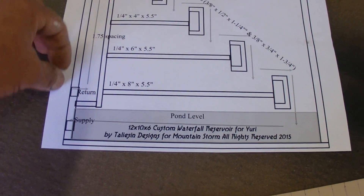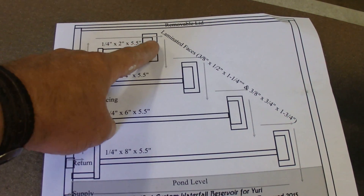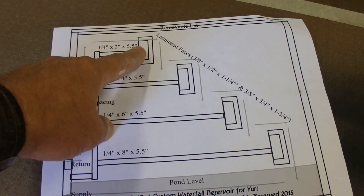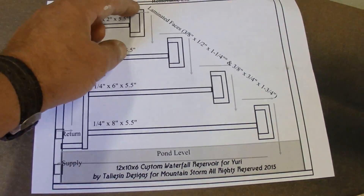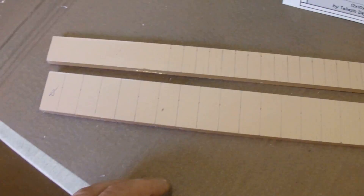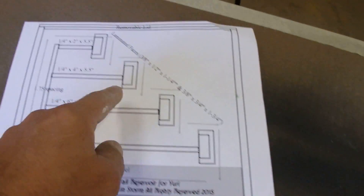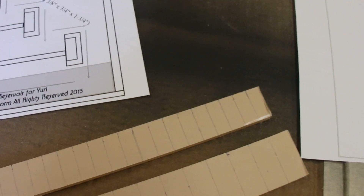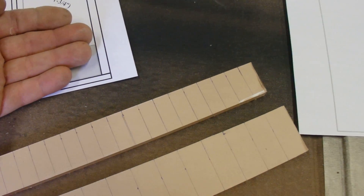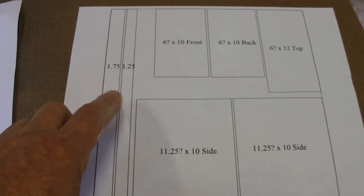Here's the reservoir design — it's 6x10x12. Here you see the 10x12 part of it. I made a video earlier demonstrating these little ledges. These are stack laminated out of 3/8ths material. I'm cutting all these little pieces out of 3/8ths and stack laminating them until they're 5-1/4 across. Here are the pieces getting ready to be cut out. I've got my cut list for the 1/4-inch material — that's all my internal parts — and my bottom that the 3/8ths will sit on top of to make a nice strong glue joint. The lid will get a rebate all around the top because it's removable. Here's my cut list for the 3/8ths material.